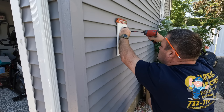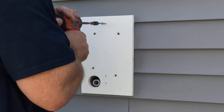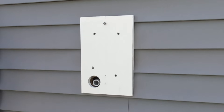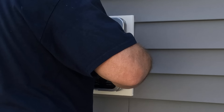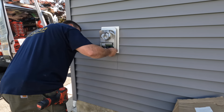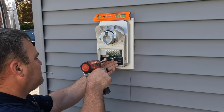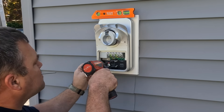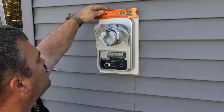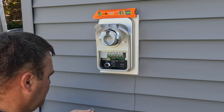I'm using two-inch or two-and-a-half-inch galvanized coarse screws to mount the board. The vehicle charger will cover up those screw holes. That screw I'm putting in right there is actually what the charger mounts to — once the charger is up on the board, you no longer see those mounting screws. Then I used two stainless steel two-inch coarse screws to mount the bottom side of the charger. The charger does come with hex head screws, but these number-eight stainless screws are fine and this thing's not going anywhere.